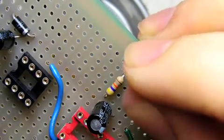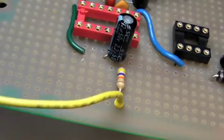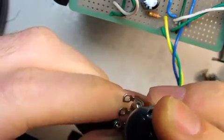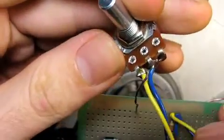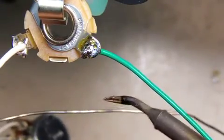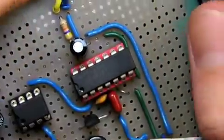Flexible stranded type wire is your best bet for hooking up external parts. Melting and smooshing down a small amount of the wire's insulator at the solder joint can even provide a little bit of strain relief. A spot of hot glue would probably do even better. Using a variety of wire colors helps me keep track of the connections for each potentiometer and jack.